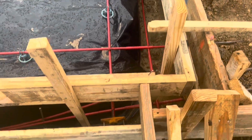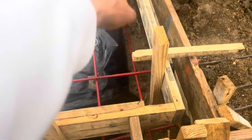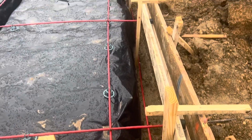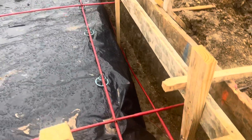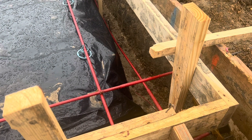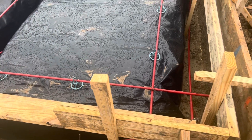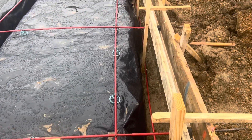You've got to have all this concrete. When they dig down into these holes, they dig these trenches out for the piers. They're digging down to the undisturbed soil — that's very important. They're reaching down below the top layer, down to soil that's been undisturbed for thousands of years, maybe.